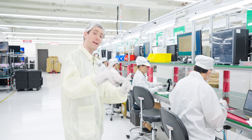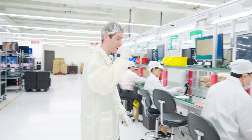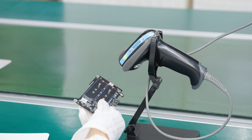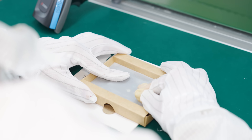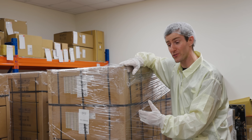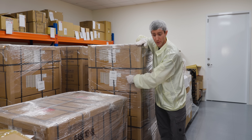Coming back to production, it's time for retail packaging. They're not packaging GPUs right now, so half the line is packing Framework dual M.2 SSD carriers instead. The first station flashes firmware, then the serial number gets paired with the QR code on the packaging sticker, and it gets boxed into a master carton and sent off. Finished GPUs get staged on pallets for shipping to markets like Hong Kong and the US.